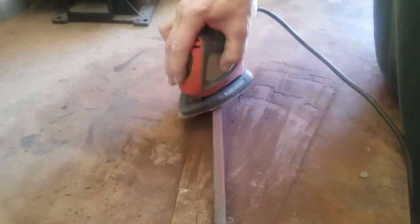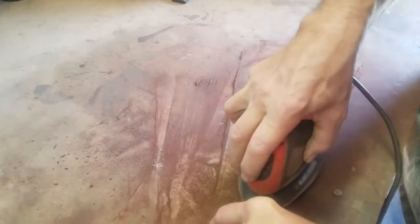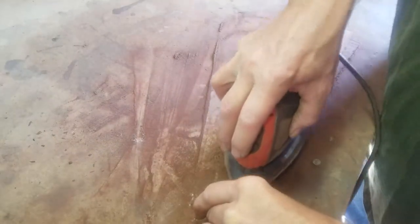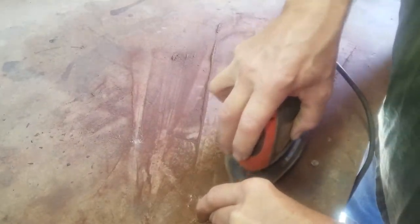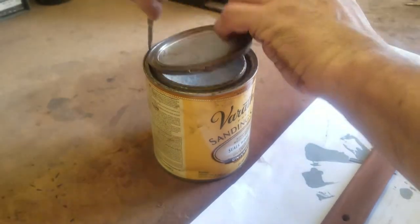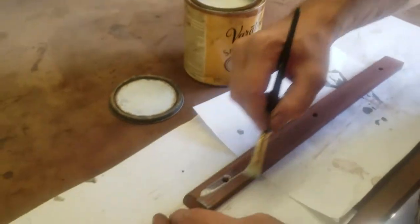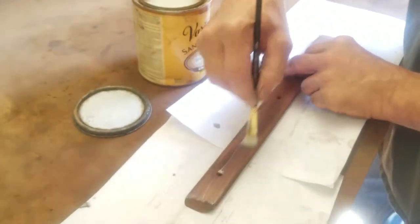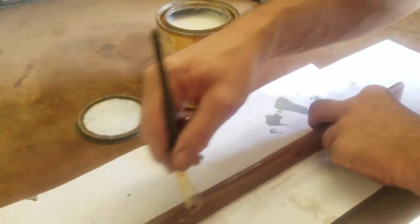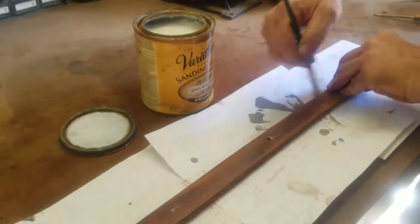The lower pieces — the back edge shows — are cleaned up the same way. So everything's gone over this way until I'm happy with the basic condition of the part. Then we're going to dust everything off, switch to Varathane sanding sealer and a high quality brush, and actually paint the entire piece — every single bit of it, even any paint on the backside we didn't remove. The objective is to seal up the wood and give us a nice surface to paint on.